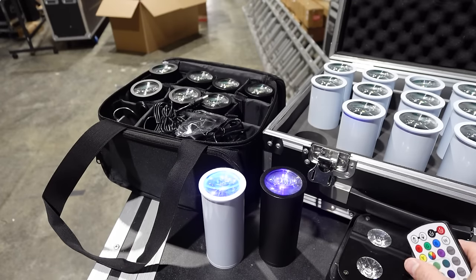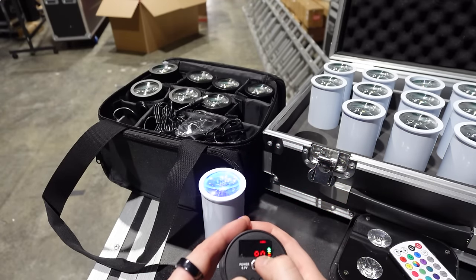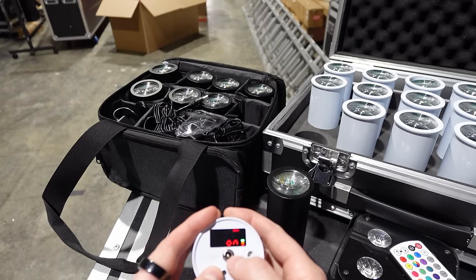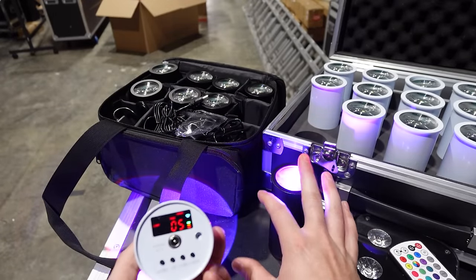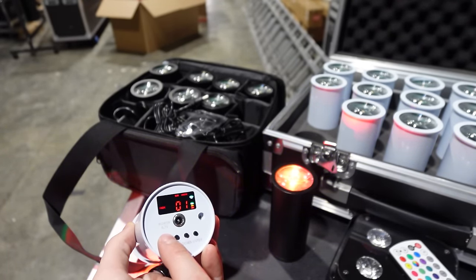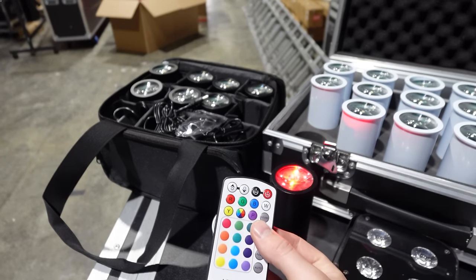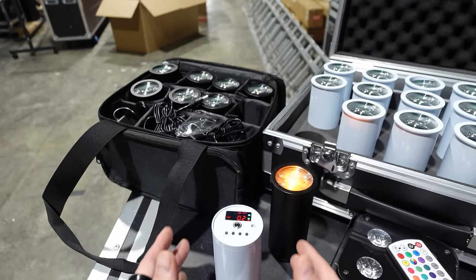You can also master-slave the lights independent of the remote. Go to the master screen and turn the master off on one unit, set it to slave via the DMX screen, make sure both are on the same wireless DMX channel, and the master will communicate its color to all slaves. The only way to change settings is by adjusting the master light's buttons directly — for example, changing fade scenes from the master unit sitting on your DJ table. Those are the two non-DMX control options built into the light.